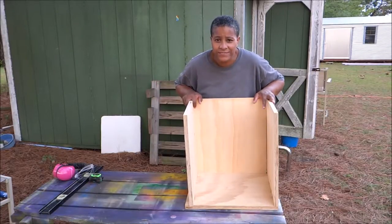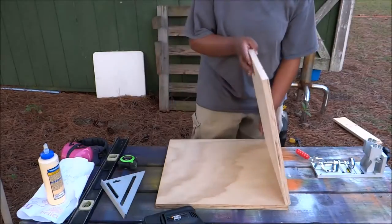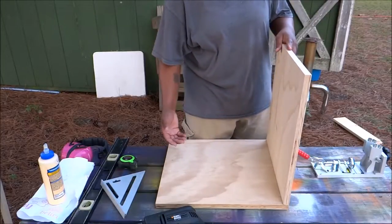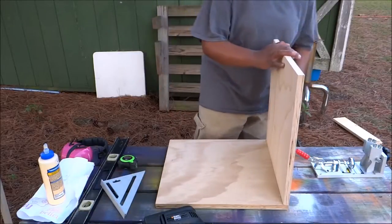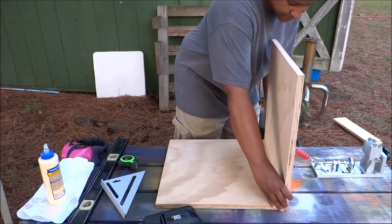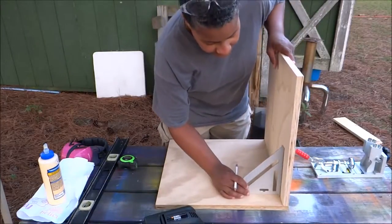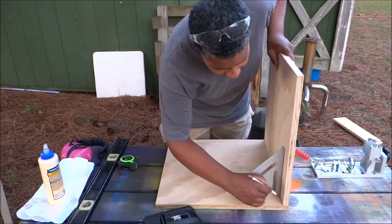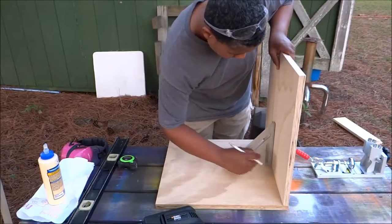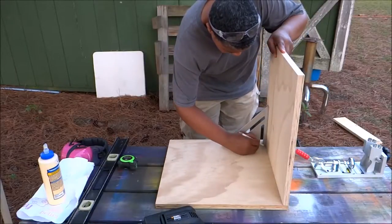The first thing I need to do is measure some stuff out. I'm trying to find the best piece that looks great on the outside because this is not going to be painted — she's going to be using some different colored fabrics so she can change the color of her background. So I'm going to line up this edge the best I can and put three screws in this. I'm going to mark my space out with this framing square so I can line it up exactly where I want it. One at the end, one somewhere in the middle, and somewhere around here will be my third screw.